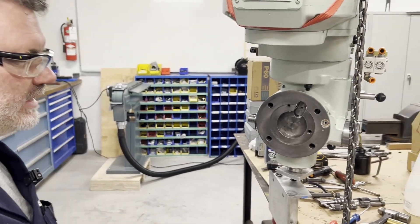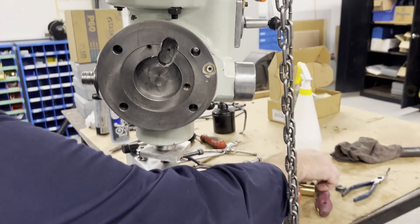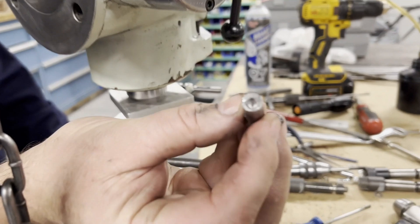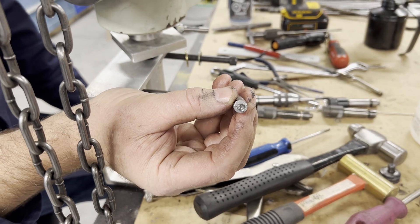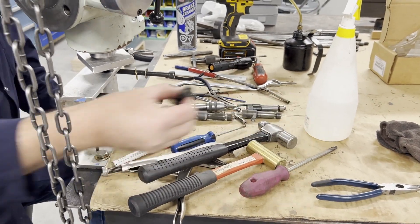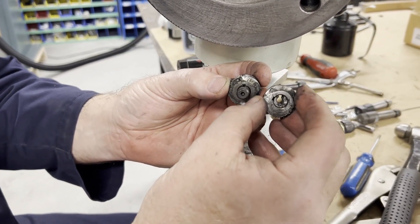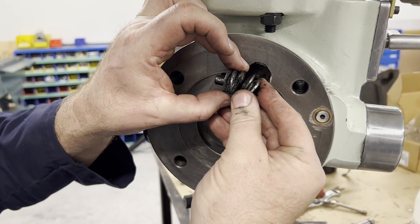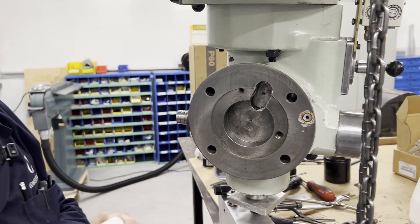I have the broken parts extracted, though it was a bit of a challenge. In the past I've been able to drill a hole into the stub in the blind hole, put a tap on it, and pull it out with a slide hammer, but today I was not successful. I couldn't get past the burr of the break. So I went in here with an angle grinder, cut the gear into two pieces, and took it apart the rough way — but that's sometimes the way you have to do it.